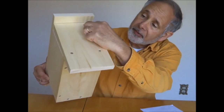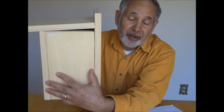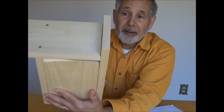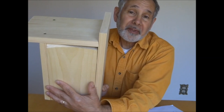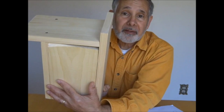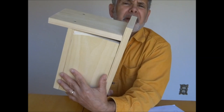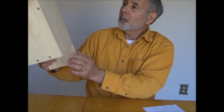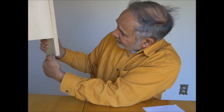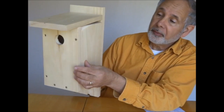This right up here, there's a crack because, of course, it's not square to that board, it's just tilted. If you wanna get fancy, you can cut the board to make it fit real tightly, but I never have. There's a bit of a gap there, which I've sealed up with a little bit of caulk. I've used paint, I've used contact cement, whatever. But I do go along there and seal that, because I just picture rain going in right along the back. When we put the back on, it extends, of course, below and above. That's just so you have additional space of wood to mount the thing somehow.